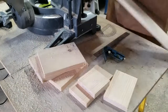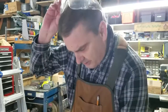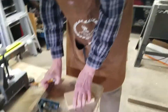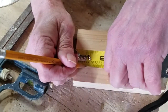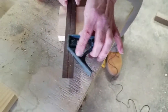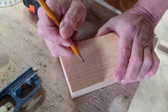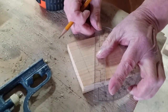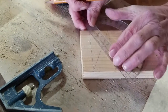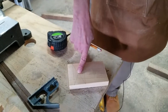Now we have our pieces, and we've got to put the doorway in for the bird. We're going to put that towards the top — coming down at least three quarters of an inch from the top. I'll make a mark there, take my combination square, make a line, then do the same at the bottom. To find the center of this board, I'm going to go corner to corner and draw a line both ways, and what we'll end up with is an X that gives us the center of our board where we'll drill the hole.